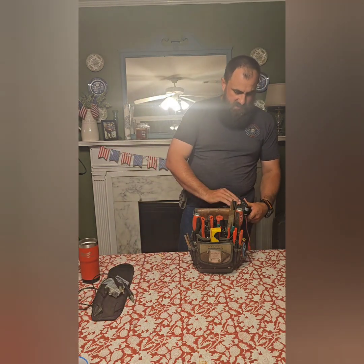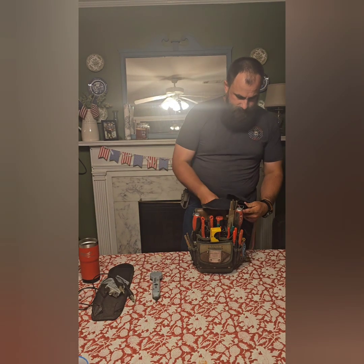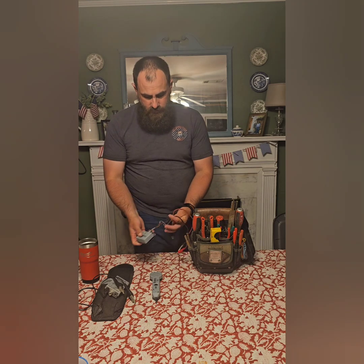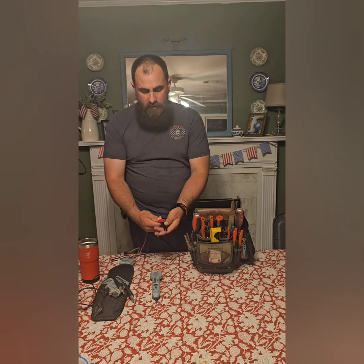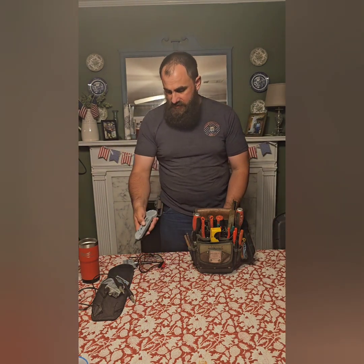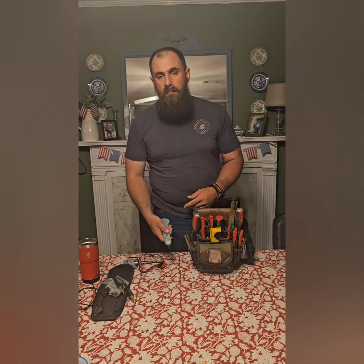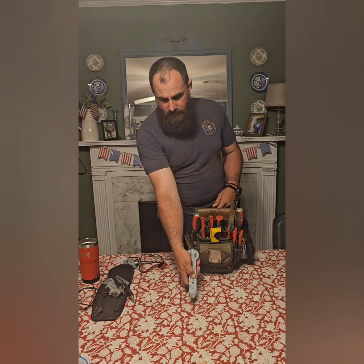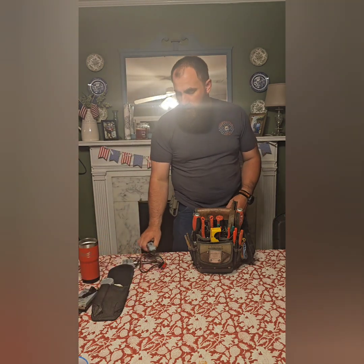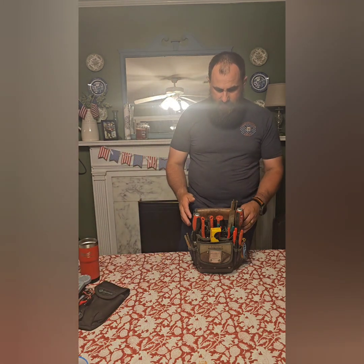Over here is essentially the same thing. I've got a toner, but all this does is send a tone down the line. So if I'm out in the field working on wiring, I go to the controller, hook this up, and I've got my toner. I can go out in the field and test — if I've got a bank of valves and I'm not sure which one is zone three in this valve box, I hook this up to zone three, go out there, and identify it. Then I can use this out in the field to tell me whether that solenoid is good, bad, or whether I have a wiring issue. Really nice to have right off the bat.